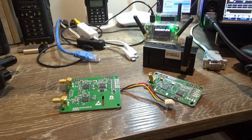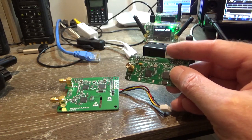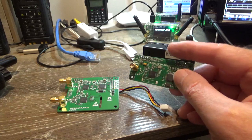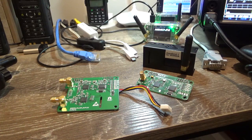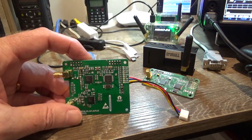They work a little differently in their operation because you can go into DMR timeslot 1 and timeslot 2. If you're on Brandmeister, it's all timeslot 2. On the VK DMR network, some talk groups are timeslot 1 and some are timeslot 2 — the network resolves the timeslot 1 side of things. So basically, everything on your codeplug and radio will be timeslot 2, but any timeslot 1 talk group will get resolved through the network. But if you want the true full DMR capability, I suggest you buy or build yourself a duplex hotspot.